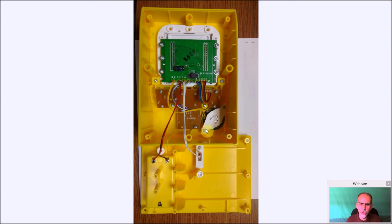We're going to be taking these two screws out and reusing the speaker. This will come right out with these two screws. Then take out this screw here, this screw here. The sound on-off button will come out easy. Then 1, 2, 3, 4. The joystick section, 5, I'm sorry, there's 5 buttons here. The joystick button will come out here. And then you take out 1, 2, 3, 4. This whole assembly will come out. Now these here hold the boards together to the white thing, the white bezel. But it's really just these 4 screws. When you take all those out, that's it. Everything will come out really nice and easy.